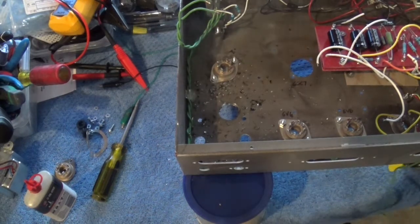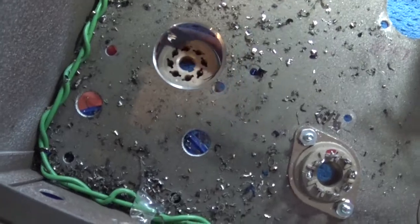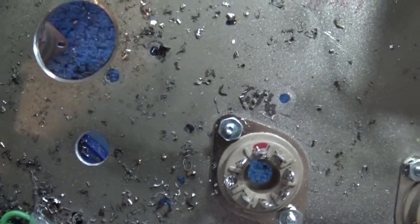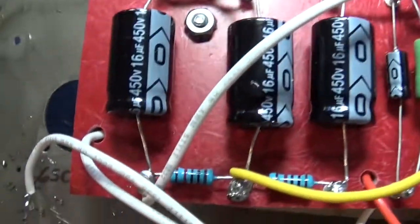Okay, I'm going to do the rest off camera because it's really hard to do with one hand. I'll be back. Okay, the hole's the right size, and you'll see that the socket fits in there, right? But I do have to clean it. There's a lot of burrs on the inside here, so I'll get a file and I'll clean this. I'll take this outside and file, get all these filings out of here, and I've got my hole. So it's going to look something like this.